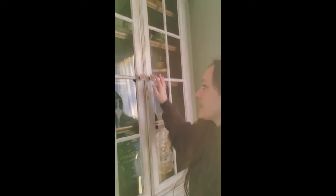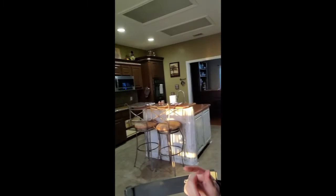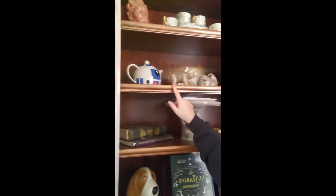I am almost done with this kitchen makeover and this is one of my favorite things — this built-in, which I didn't really care for when I moved in. It was that orangey oak color and just ugly. So I painted it to match the island and gave it that white rustic feel. The only copper I've really added on the inside — I painted the inside as well but tried to make it look aged. I used a brush the whole time. I think the key to aging or distressing something is using a brush instead of a roller because you want those imperfections. Just chalk paint, then covered it with polyurethane, then used copper on these edges.